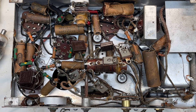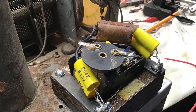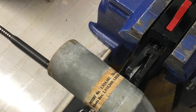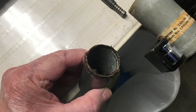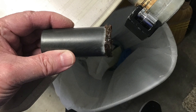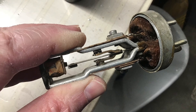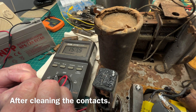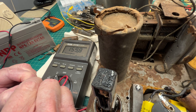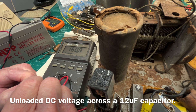A quick update before I conclude the video: I started with the power supply section and I'm up to the choke and electrolytic capacitors. The synchronous vibrator did not turn on — I could hear the relay clicking and figured the contacts were kind of stuck together. That's what I found, so just a little cleaning inside after opening the synchronous vibrator. It seems to work now — who knows how long it will last, but here we go. Thanks for watching.